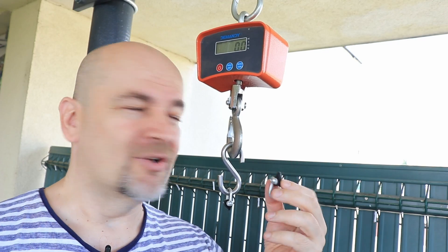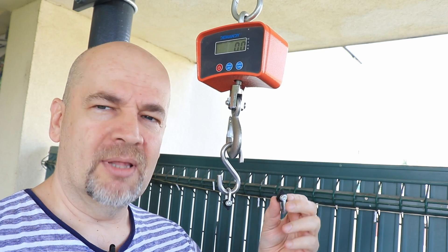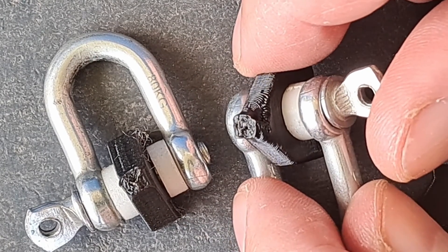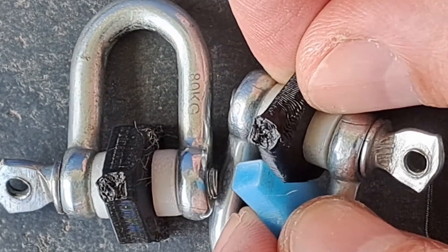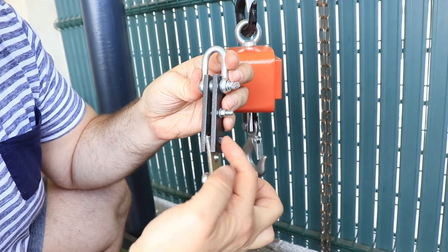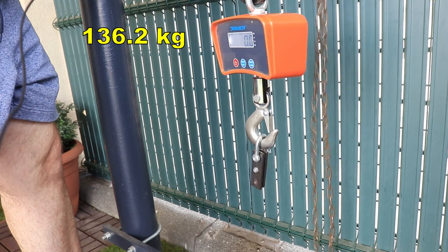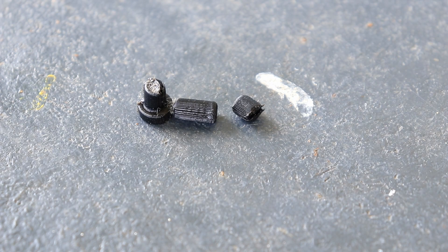I didn't want to use the chain hoist here because usually layer adhesion is not so strong — I can easily pull it with my weight, but yes, this was very strong. Look at this irregular break surface: even without numbers I could immediately tell that this has strong layer adhesion. For comparison, this is how it breaks between the layers when adhesion is weak. Two-sided shear stress — the diameter of this test object is 5 mm. It sheared correctly into three parts on those two cross-section areas and the filling was very strong.